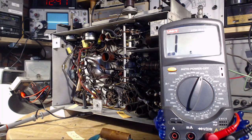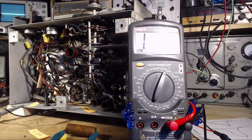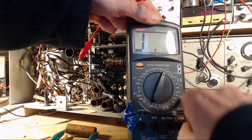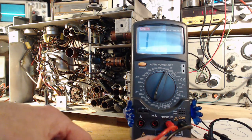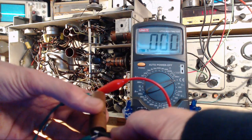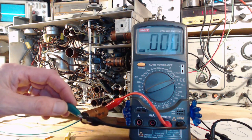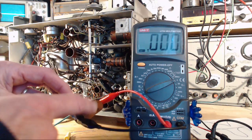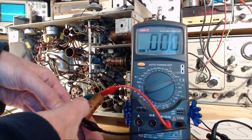Now we're going to hook up the voltmeter. I'm going to use clip leads to do this. A little experiment here. Put this on here. Lock this on. DC, say 2 volts. And we should see 0, of course. And I'm going to lift one of these leads off, and if that thing comes off 0, there's still 2 possibilities. One is there's still residual charge in the dielectric, and the other one is there's a galvanic voltage. There'll be a way to tell them apart. Here we go.